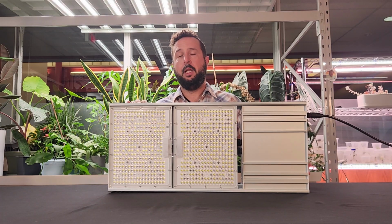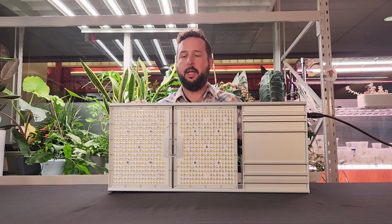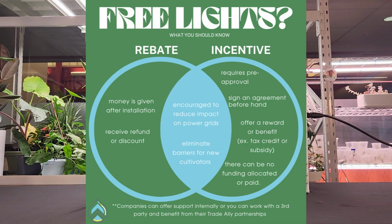Going from 1100 watts for a 1000-watt fixture down to 800 or 820 is going to save about 30% of the total power draw, so that could draw significant incentives and rebates from the power company. Again, if the power company pays by the watt, then the 1200-watt fixture again could make more sense.